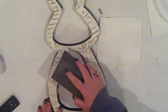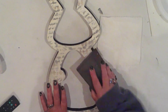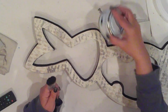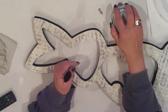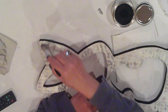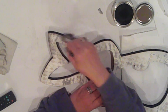Next, I give it a light sanding, focusing mainly on the edges to give it that worn look. Then I'm coming in with my Jolie Black Finishing Wax, again focusing mainly along the edges, just kind of dusting it on and wiping it back. I'll build on it this way until I'm satisfied.